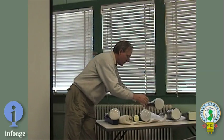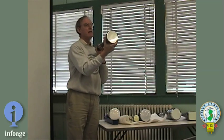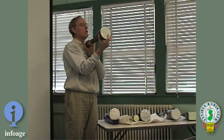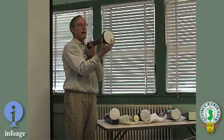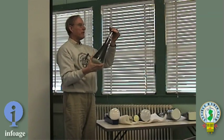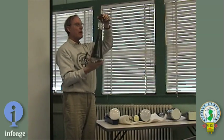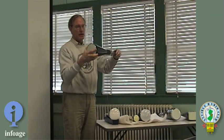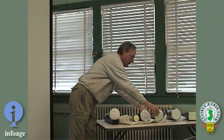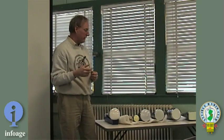A little later on, your friends down the road at Hewlett-Packard developed a flat screen for a CRT. This allowed you to put a graticule on the front of the tube and actually read a voltage without having to read around a curve with your eyes — a great development. But still, this is only a couple of hundred kilohertz to a few megahertz. It made a passable oscilloscope, and you'll find a lot of these in flea markets in the 120 series or rack mount.